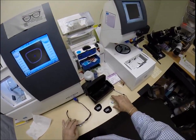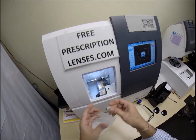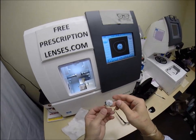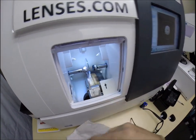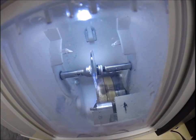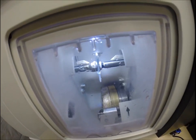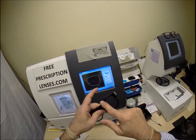That snaps in there much easier. Let's go ahead and start cutting the left lens. We're going to flip that over to L, press the sticker on firm, put the lens in. It's upside down — I flipped it. So now we're going to hit start. Just like before, the door closes, the clamp shuts, and then the lens will begin to be traced by the two white styluses, making sure the lens is large enough to fit into the frame, and you can see how close it will come to the edge. Again, measuring the thickness of the lens at every point to know exactly and precisely where to place the bevel so you have the least amount of edge thickness showing.